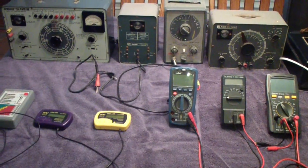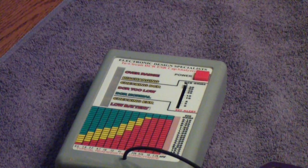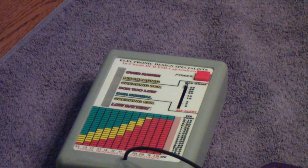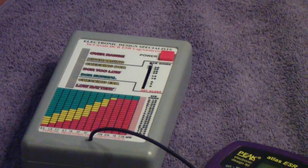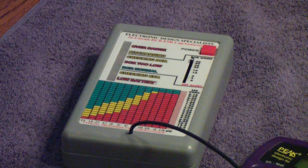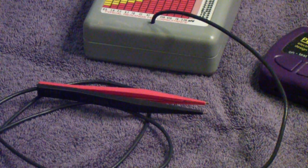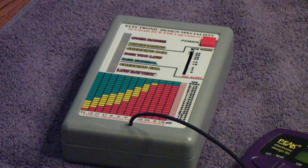In the front are some second-generation testers. The first tester on the left is an ESR tester — equivalent series resistance. With the advent of transistorized and later integrated circuit equipment operating generally in the range of a few volts up to maybe 25 volts or so, the critical parameter on a capacitor, especially with switching mode supplies operating at fairly high frequencies, became equivalent series resistance. If you watch Grant's Pass TV, he uses this a lot for TV repair. It's very good for testing surface mount components and comes with tweezers optimized for surface mount.